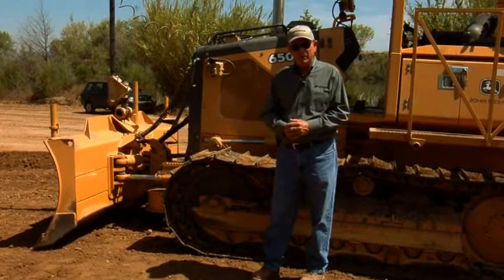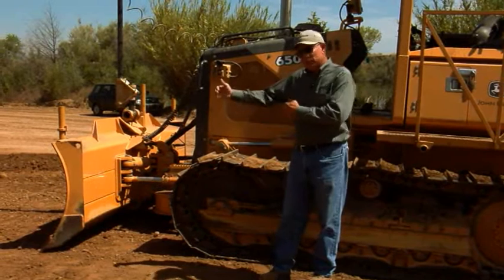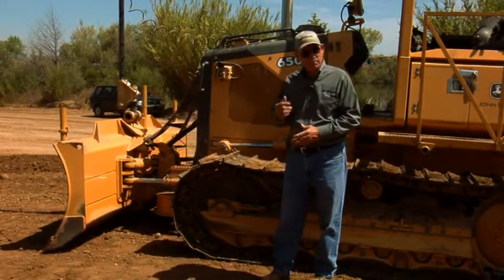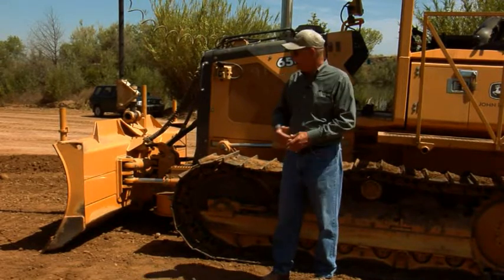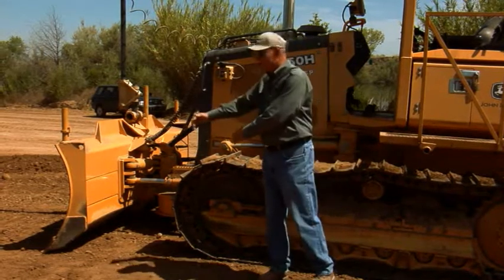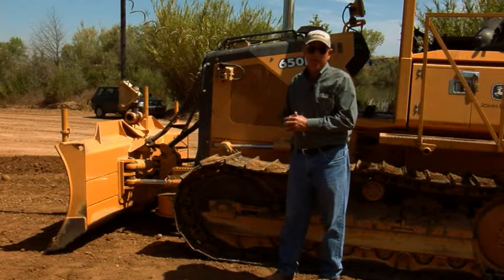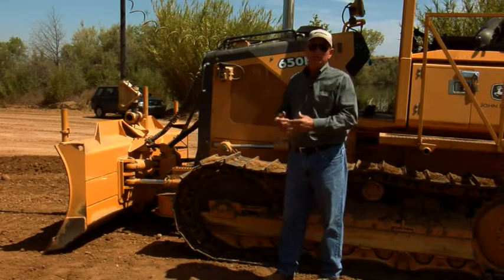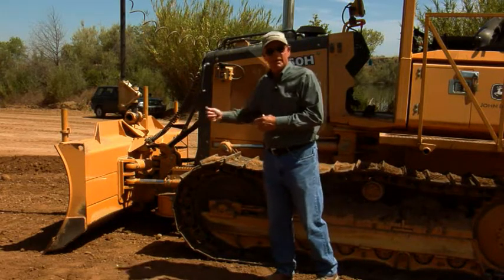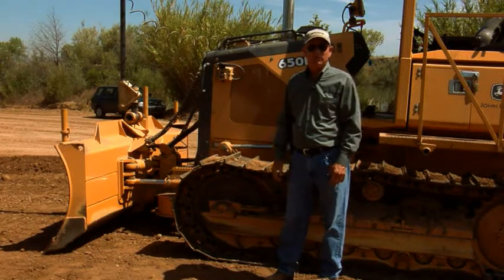The other part of 3DMC squared that is truly revolutionary is the control algorithms. The hard part about a dozer is the nature of the dozer itself, so the other piece we do is actually measure this machine. We measure the track length and the distance from the tracks to the cutting edge. We're creating a model of what this particular dozer looks like. Then we can use sophisticated control algorithms that model the machine, as well as the instantaneous position measurement from 3DMC squared, to get the results we're getting, which is, again, truly revolutionary.